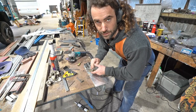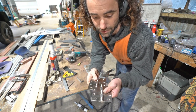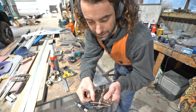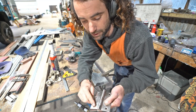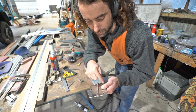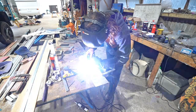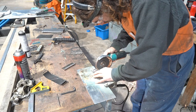These are the hinges I'm using — they're oversized hinges, but where I need to cut them it's going to go slightly through these holes. So I'm just going to use the stick welder to fill these holes, then I'll rub it back and cut them down to size. I've got my blank hinges here.